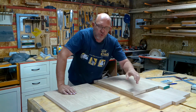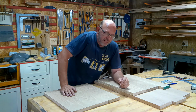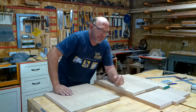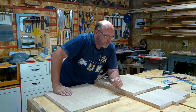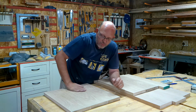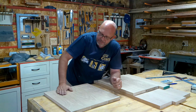The top of the little table, whatever we call this, I made 710 millimeters, which will give me a 5 millimeter gap on each side, so there should be enough space. They're usually quite straight. So I just lightly sanded them just to get the worst of the glue marks away and see how my glue lines came out, and I'm very happy with my glue lines.